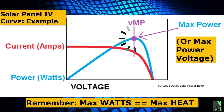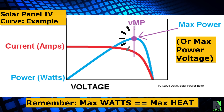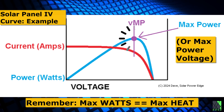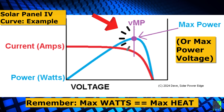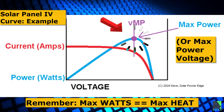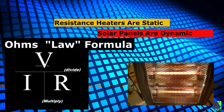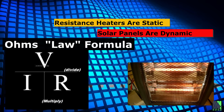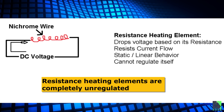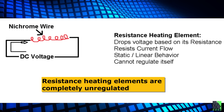But there is a simpler and lesser known method of utilizing the maximum power point of a solar panel array. Simply put, it's to recognize that as long as the voltage of the solar panel array is allowed to stay at or near the optimum voltage, it's enough to get most of the power. This could be called constant voltage tracking. A resistance heater is static and therefore, when directly attached to solar panels, the voltage is unregulated and can swing all over the place. You cannot get the maximum amount of solar electric heat from solar panels with just simple resistance heaters alone.